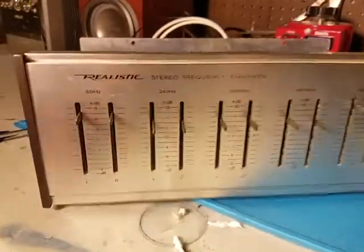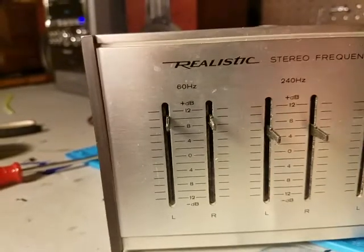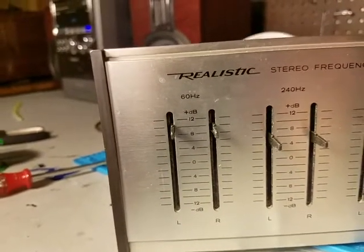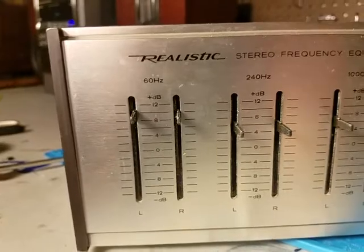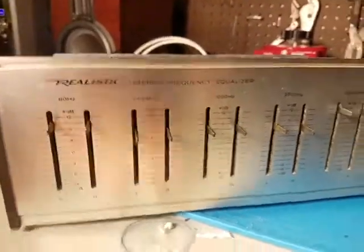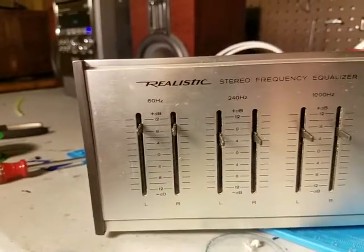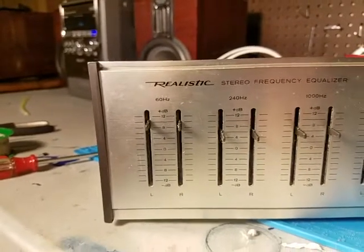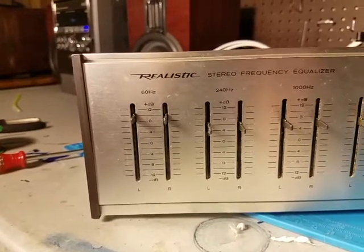I think I got it good enough. That's where it quits right there, which is good enough for me, because I'm really not going to crank it up to plus 12 decibels on the bass — it's just going to sound like one of those bass-boosted YouTube videos. I did clean out the potentiometer with a Q-tip and went through both of them, and it seemed to work okay. I think this is where I'm going to call it, just because I don't want to wreck anything — I'm actually going to use this. I like this thing. Anyway, thank you for watching.